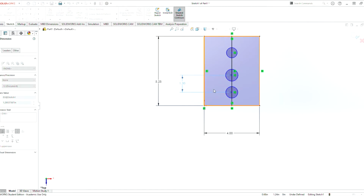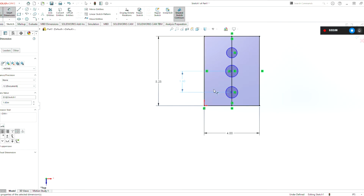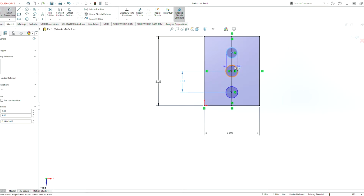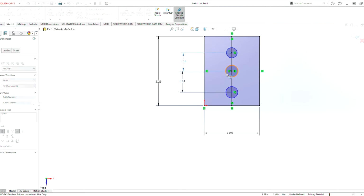to get the distance. For the gearboxes that we're making, if you have a 64 tooth gearbox, so if you have one gear be 14 and then another gear be 50, the distance between center to center is 1.6 every time. 1.605 because we need to have a little bit of tolerance so that the gears aren't super close to each other. And that's the same thing for the output shaft. For the motor.